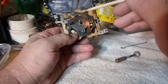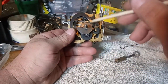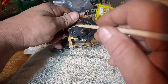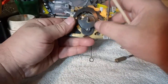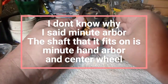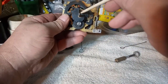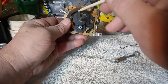The rack is what counts the hours. The snail is what tells the rack how many hours to count. Each one of these tabs on the snail — this is called the snail; if you look at it, it looks like a conical snail shell. The relative position on the minute arbor of the snail is what helps tell the time. There are twelve spots on this snail to help count the hours.